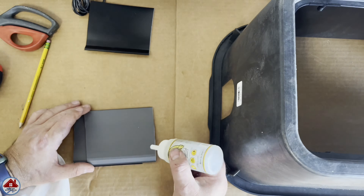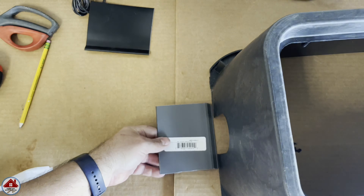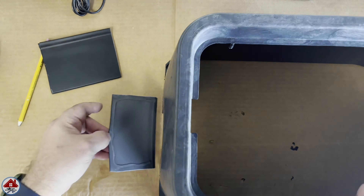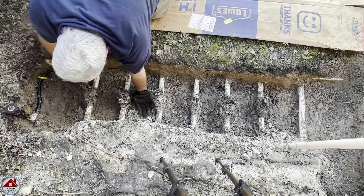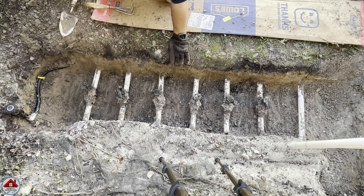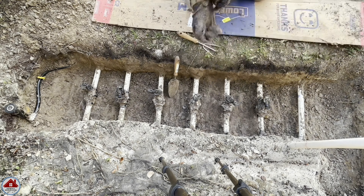The next modification I made to the boxes was to close up the openings that normally allow pipes to run through, depending on how you position your valve boxes. I'm using cut-up pieces of thermoplastic rubber and vinyl wall base — gluing them on — and I'll add duct tape over them too. Here's another shot of me digging around the valves. I need to lower the dirt level even more to make room for the pebbles that I use to help with drainage. I continue to use the cultivator to rake out the soil, then use my hand trowel to dig the dirt out little by little.